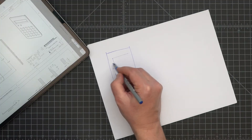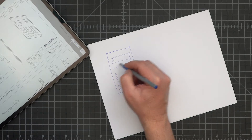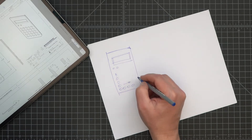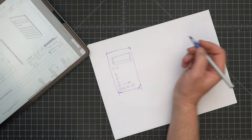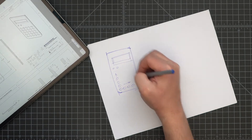To make a CAD strategy, get out a piece of paper and a pencil and start sketching the 2D shapes that make up the calculator. Since you can't sketch all the features at the same time, you will naturally break the part down into its simpler shapes. When I did this, I tried to think primarily in terms of the following CAD operations: extrusions, cuts, fillets, and chamfers.